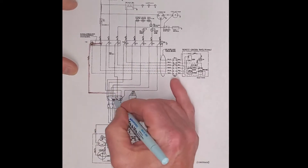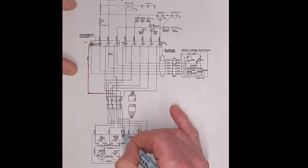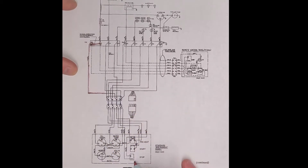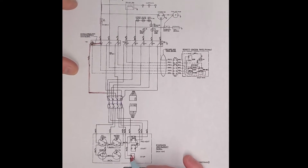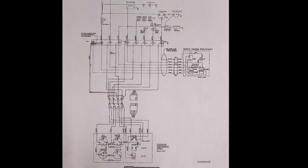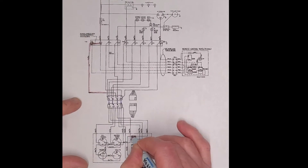We're going to follow that red wire and that red wire is going to run down. My wire is going to jump through and it's going to continue red. That wire is going to run down to my stop switch, which has continuity. When you want to shut the engine off, you trip the switch that opens this circuit.